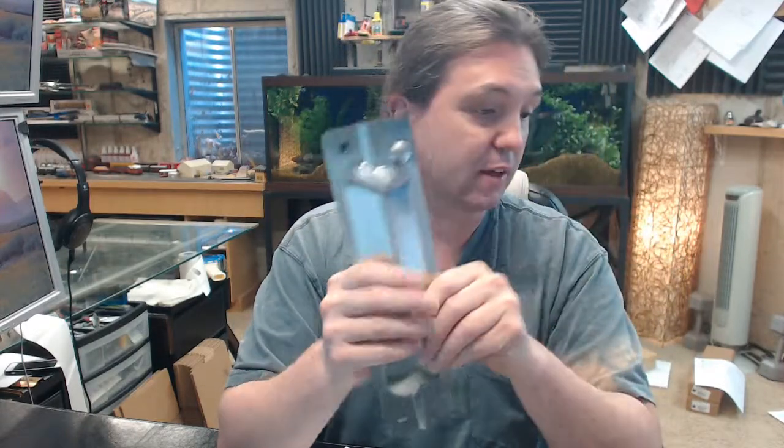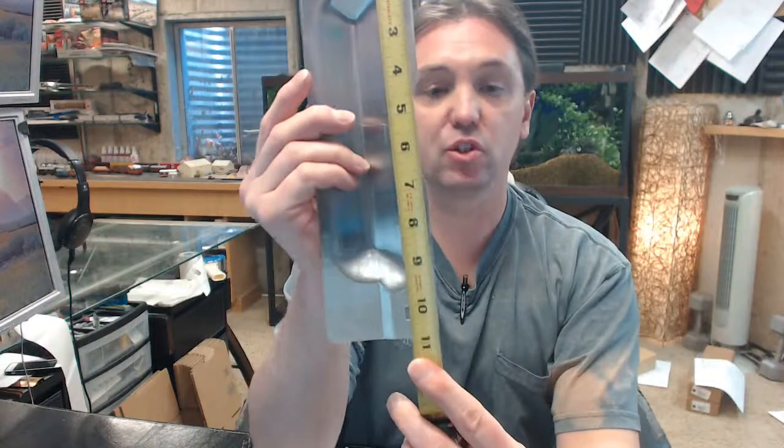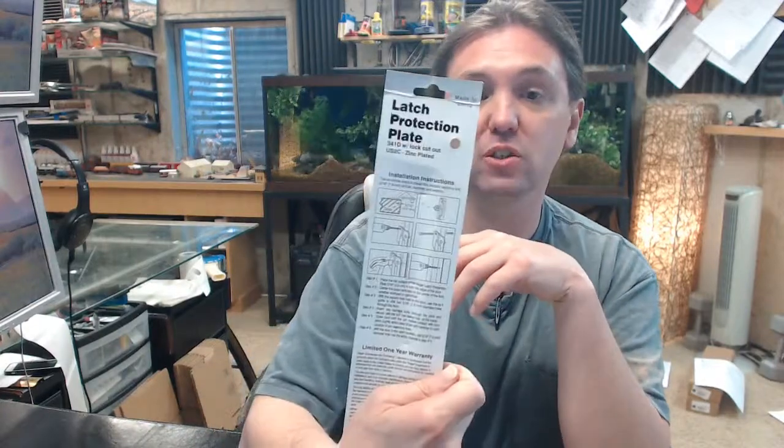But let's talk about that. Let's talk about the dimensional properties of this. This is made of 12 gauge steel, although they do state that it is steel/stainless steel. It's not. It's plain steel. This is 3-inch wide and 11-inch tall. Okay. It has that offset there. There is a link below this video to the installation instructions, and looking at that, it gives you the data that's on the package itself. Okay, so you'll be able to review that prior or after or during installation, prior to purchase, whatever the case might be.